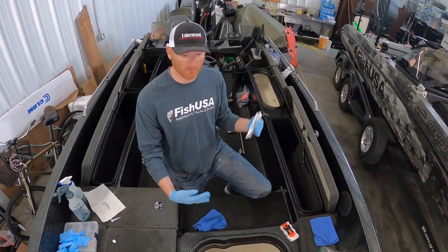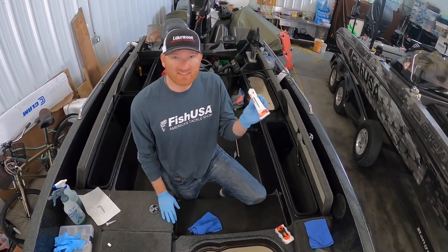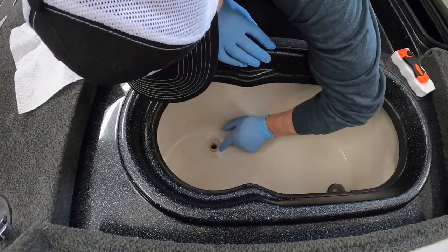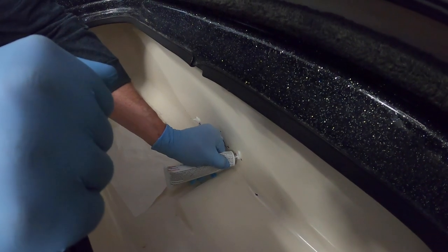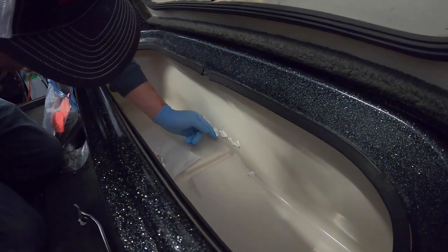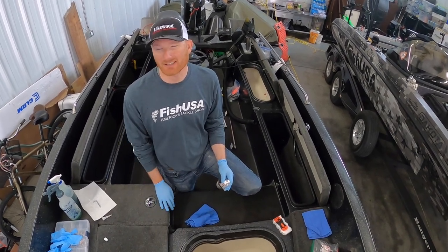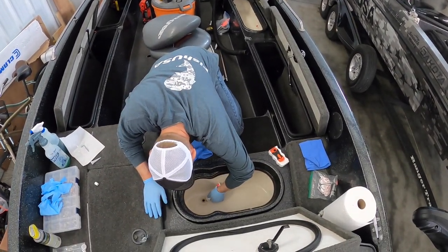On these older boats you're going to get chips and dings — it's just a reality. A simple way of fixing that is to seal it up, especially in the compartments or the live wells. Both the front and rear live wells have dings where people put metal stuff in. Something like 3M 5200 works — it's a watertight seal, but be careful, it's nasty. Make sure you use gloves. Use the fast cure, which only takes a few days, because the full-strength stuff takes about two weeks. For little gouges in fiberglass, especially around drain plugs, they also make this in black. You can kind of cheat and cover things up without doing glass work.